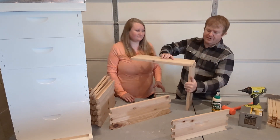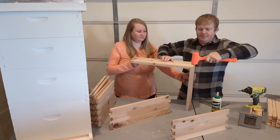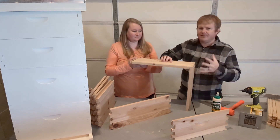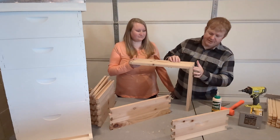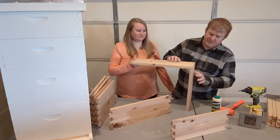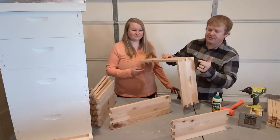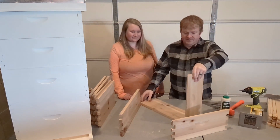We've got that glue in there. We're now going to come in with our side piece. It's a great time to use your rubber mallet. You can use a regular hammer, but if it's binding and not going together, don't force it — you don't want to break it. As you can see, not a lot of glue running down; I just had a couple little spots to clean up. We're going to set that piece there and move on to the next.